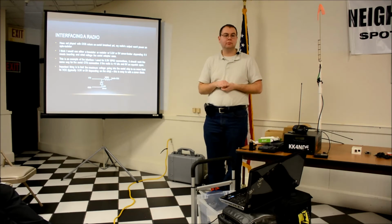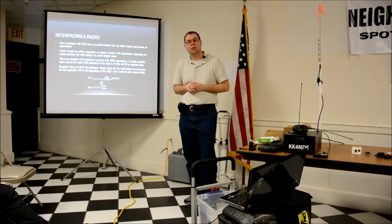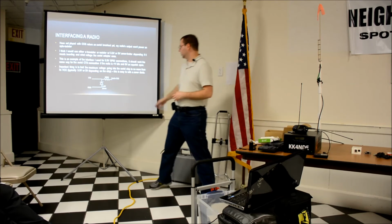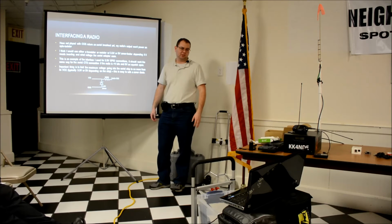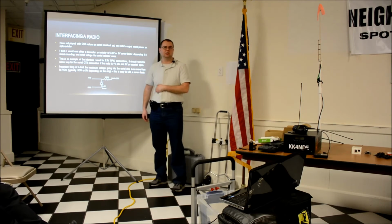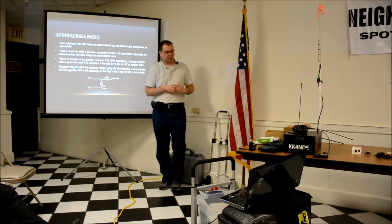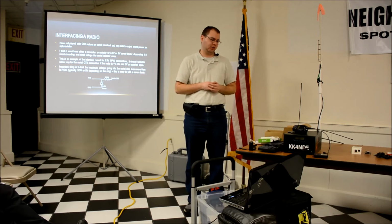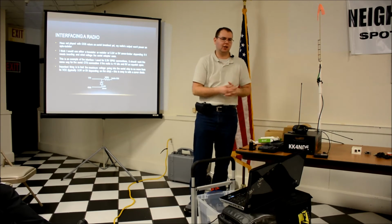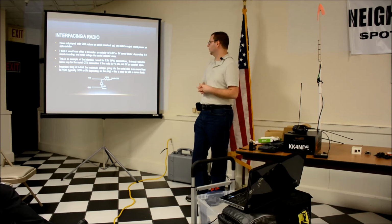It seems to work. Pull the CTS to 0? I'm sorry? I said, that's enough to pull the CTS to logic 0? It seems to be, because you could connect a ground across there. I was afraid I'd end up with a ground loop because the ground is shared on the power supply as well. It seems to work well enough pulling it to 0. When I was poking around in this, I didn't have much issue with the grounds being at different levels. Everything's very tight and compact, and all the connections are close together, so that may have helped me.